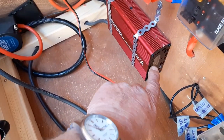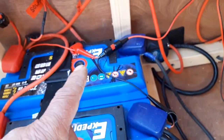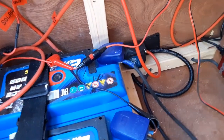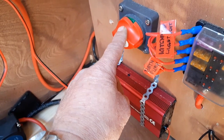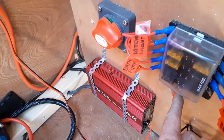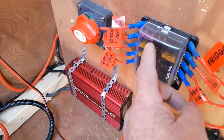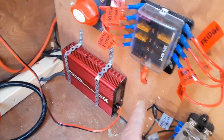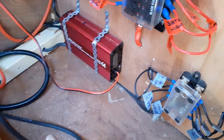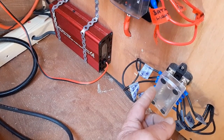Coming round this side, it's got a display screen to tell you what it's doing, and then the cabling runs off to the batteries — it's a bit like spaghetti junction at the moment and needs tidying up. From the battery, this red cable goes into the back of the isolation switch, then from the isolation switch it comes back through here into your 12V positive side. Everything is being labelled as to where it's going. Not all fuses are in place yet because the other side isn't complete, but the ones that are done have their fuses fitted. Below that we've got the earth wire which runs round to the earth point, and all earth wires are labelled as to where they're going.